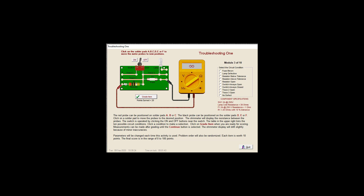We got infinity through there — that's not good. Let's go to trace 3 — that is good. So let's just go test this — that's good. 39 ohms is reasonable for our lamp. Let's check the switch — it's our resistor that's bad. But let's check. And that's good. So let's get our resistor: no good. Resistor is open.